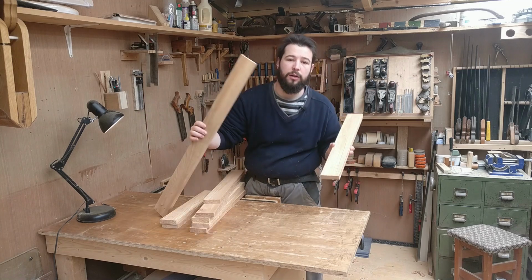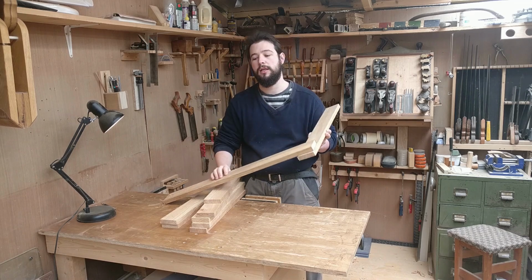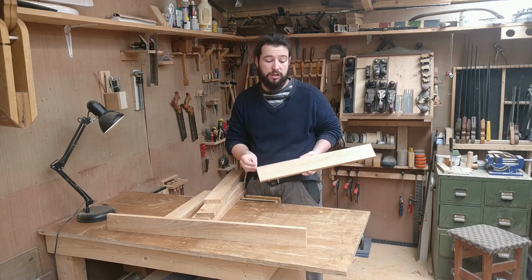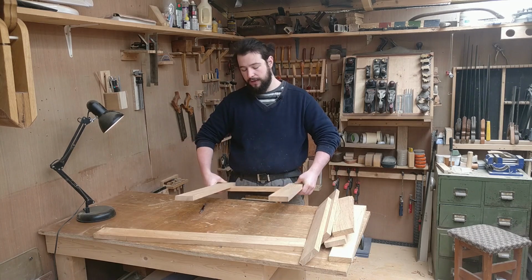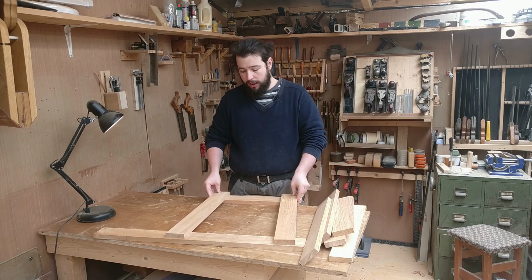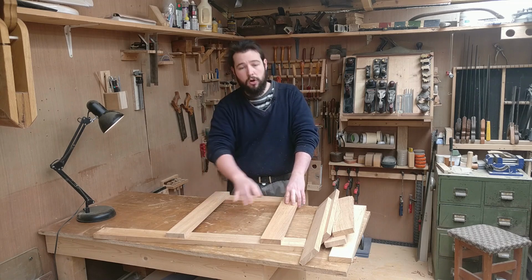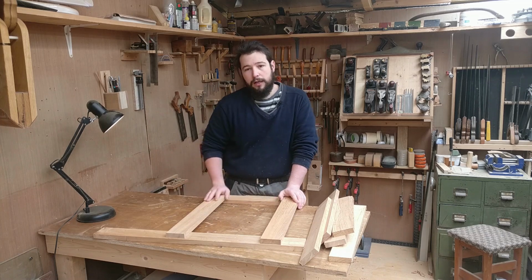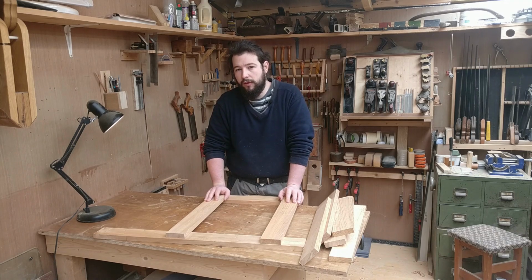And I will do the same thing on the adjoining piece like this. So each of them will have half the thickness taken off, and they will go together nicely. And they should be very easy to do, quick to do, and they should look decently well. Of course you will see end grain from the sides, but I'm all right with that. And then I'm going to make a recess in the back for a panel to go into and glue the entire panel in around. On the sides I shall have runners for my drawers, so I'll have 5 on one side, 6 on the other side, and they will go the full length of the panel and they'll be glued in, and they should hold it all together and in place and should prevent any warping or cracking, I hope.